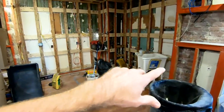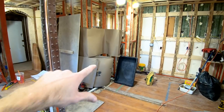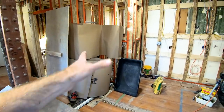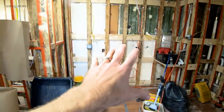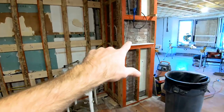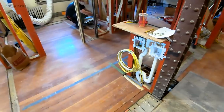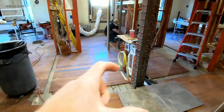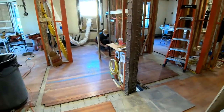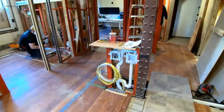Ken is working on revised shop drawings for the kitchen — it's going to be a pretty cool kitchen. Actually the first time I've ever done below-counter refrigeration and freezer, which will be here — no double-height refrigeration in this unit. Some more counter space, full-height cabinetry, and then you have your range wall and your sink wall — that's where Brian's working right now. We'll get everything set up for the appliances below the sink. We're going to have a wall-mounted TV here, and then we have this island which is going to house a washer-dryer combo — an LG model, a newer one. We're actually going to have it shipped to our shop so we build the island to make sure it's as flush and built-in looking as possible, because this is tight — small space. We don't want two units, so the all-in-one works. It's not high capacity, but it's not necessary.